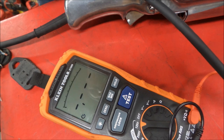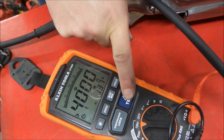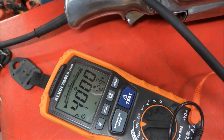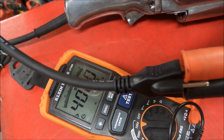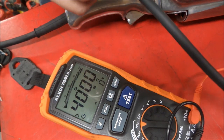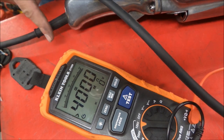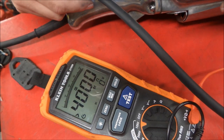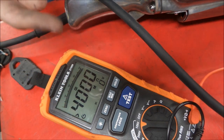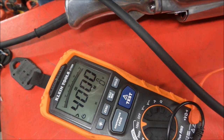Go to 125 volt test. What do we get? Maximum scale reading. So it appears as though the insulation that we added to the tool helped it out. Who could ask for more? We also have a nice new cord, and you saw when we rewired the tool, we had a very good ground. We knew we got a good ground in it now. We don't know how good that was before, but nothing's actually grounded out in the tool. We can see that. So excellent test here. Progress in all ways.